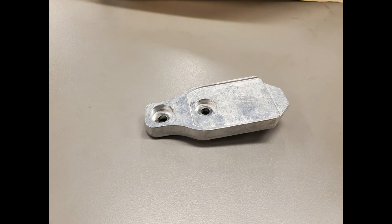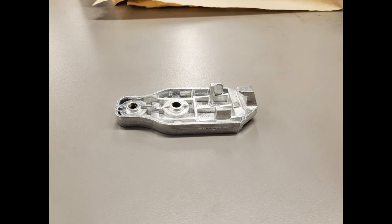The part we had to make was this cast aluminum bracket for a cubicle farm in one of the offices at work. The company that sold us the cubicle parts shorted us a whole bunch of brackets and the project needed to get finished pretty quickly, so the project coordinator came over to the machine shop and asked if we could help out. The part was die cast aluminum and we machined it out of solid stock since we're not equipped to do any die casting. It's a part to pull panels together as well as allow a decorative top valence to snap onto the cubicle so you can't see any of the fasteners.